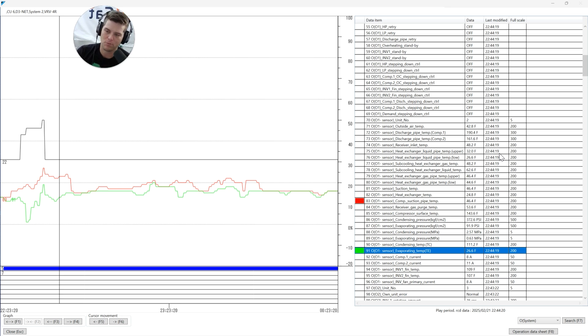It's a great safety device - it keeps us from compressing liquid. However, what happens on a system that isn't maintained properly - where maintenance has gone out the window, either someone says they're doing it and they're not, or they don't understand the technology and aren't checking all the boxes? Here we have a seven-year-old VRV4 system that has now had enough failures inside to start filling the accumulator.